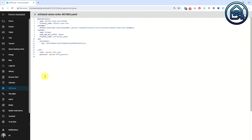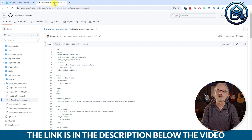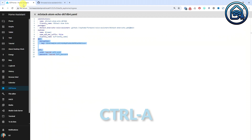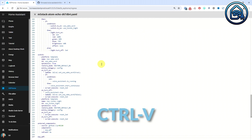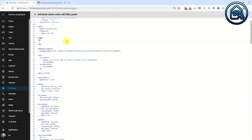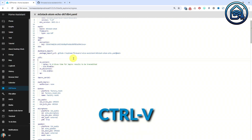Now we are going to invoke this media player in the ESPHome code. In ESPHome, click Edit in the M5Stack Atom Echo card. Copy the API and Wi-Fi lines to a text file — you will need these later. Go to the GitHub page linked in the description of this video. If you use this tutorial for the ESP32 S3 box, go to the firmware page for the S3 box — that link is also in the description. Copy the code from GitHub by clicking on the copy icon. Go back to ESPHome and replace the code for the Atom Echo with the copied code from GitHub. Then scroll up to the API line and paste the API code you copied earlier, and do the same for the Wi-Fi line. These two pieces of code make sure your Atom Echo will still work in Home Assistant.